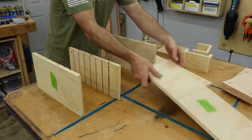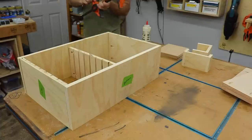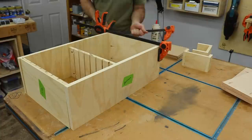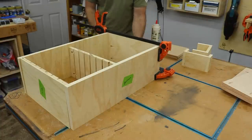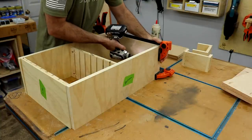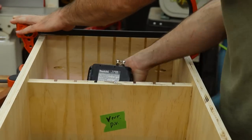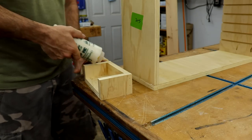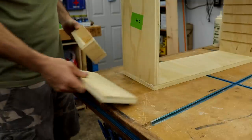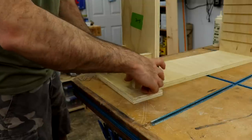Once all the slots were cut and the holes were drilled I could start assembling. I put together just the outer part of the box first — you'll see why in a second. Always make sure to use clamps when you're using pocket screws to keep everything nice and lined up. The reason for only doing the outer box first was so when I attached the side boxes I could get in there with the nail gun and shoot them through from the inside. I also used a spacer to hold it up enough to get nails into the bottom portion of the little box.